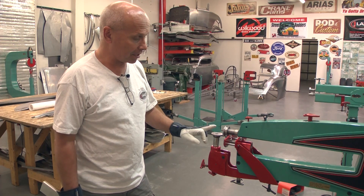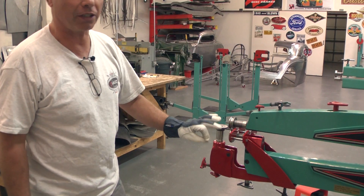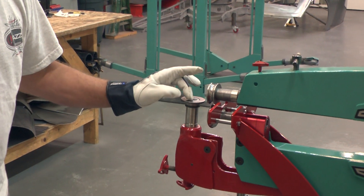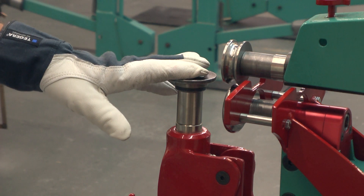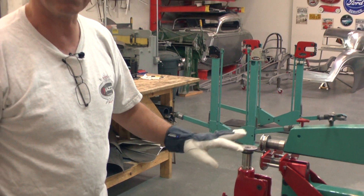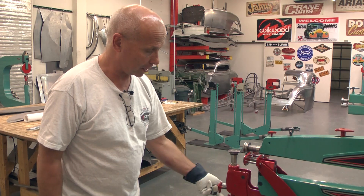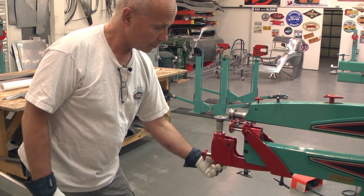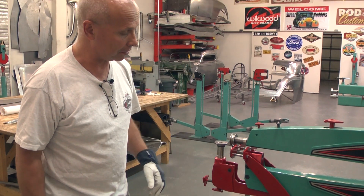So on the second generation bead roller, the shaft here drops down and goes over to that side, and I have gears there so both shafts are driven. I have this third axle coming up here and I can put any of the other dies on top, so I can have support on the outside if I need to. The reason I came up with this is that through the years of teaching I've seen a demand for support on the outside. I can change the angle here, adjust this up and down, and adjust it in and out — that's why I have this extension on the bead roller.